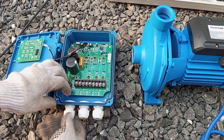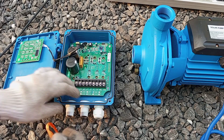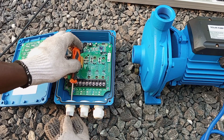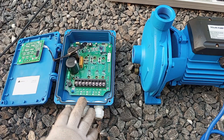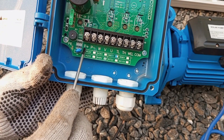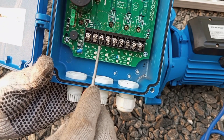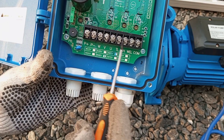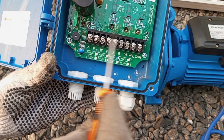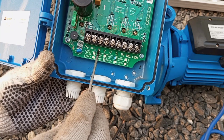First we open up the controller — cables have to enter through here. Before we connect the motor, we connect the solar panel to the controller. The connection is: positive from PV, negative from PV, then terminals U, V, W which connect to the motor. We're going to connect PV positive, PV negative, then U, V, W to the motor.